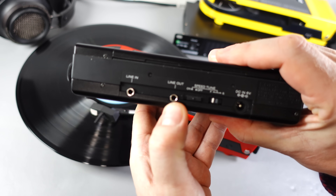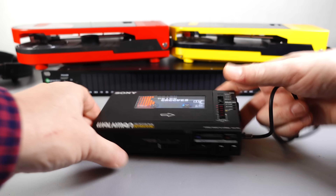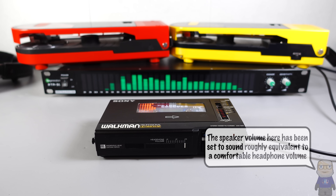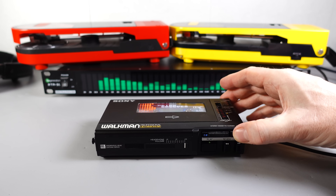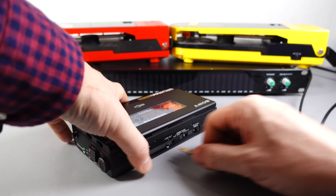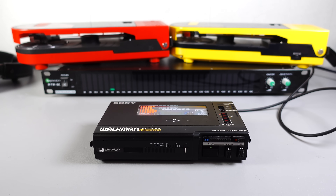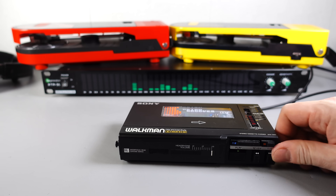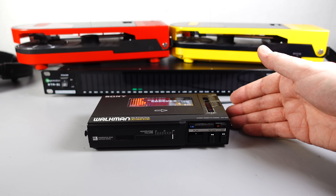To compare the output levels, I'll plug the headphone socket into these speakers and turn the volume up to full. [Audio demo] Now switching to the line out at the back — let's compare. Barely registering. That's the same result you'll get from anything where you go between a line out and a headphone output. The maximum volume of the headphone output is a lot greater than it is of the line out.